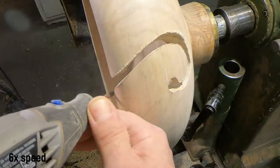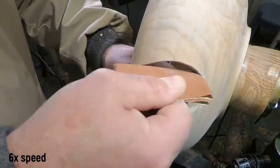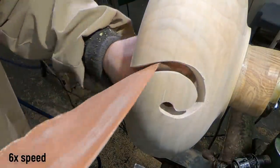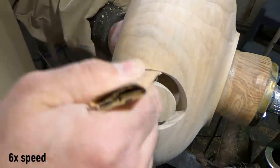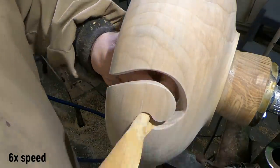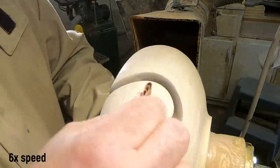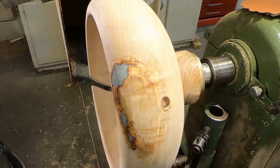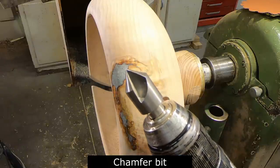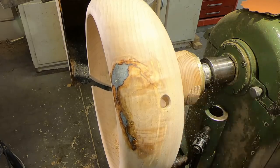Just get a little bit of a flare at the end. Then lots of hand sanding to clean out this little hook — I start with 80 and finish with 320, just like when I'm sanding the bowls. It's actually the worst part because I don't like hand sanding; if I could power sand everything I would. I'm drilling a hole on the other side using a chamfer bit — I can't even remember where I bought that one, but any place you can buy drill bits you'll probably find one.